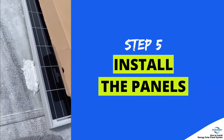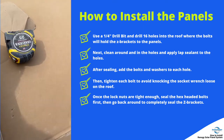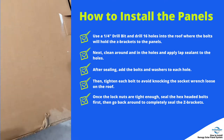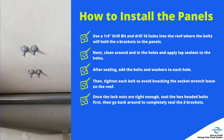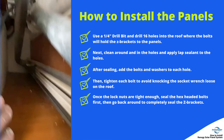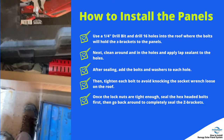As you can see, I've got the panels installed. I'm keeping the sun off them so they don't carry a charge right now. I've got them running parallel. You can see the Dicor sealant running and where I got the wires running down — it's nice and caulked up. This is inside — I've got washers hooked up to the lock nuts on the bolts, and here's where my wires are coming through. They're going to run straight down to the box and into here where the controller will go. The controller and the batteries are all going to be in here.